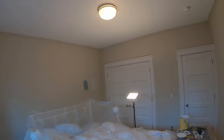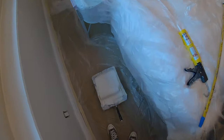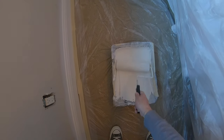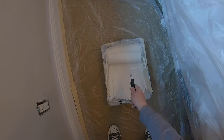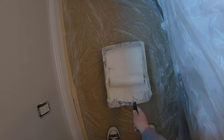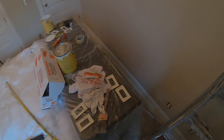Okay, don't freak out because it looks weird, right? Let it dry out, then put your second coat on. It'll be fine. I'm going to show you a trick with this. It's also in a more detailed video. Get your roller pad nice and saturated, because I'm going to put another coat on this in probably about an hour. It's drying pretty fast, since it's pretty warm today.